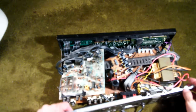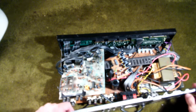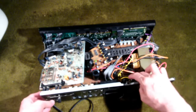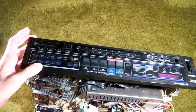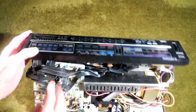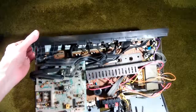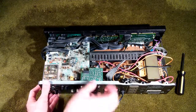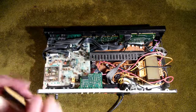And you just got to put it all back together. Be careful on this back plate — these cables are kind of short and they break real easy, and then you have to find yourself resoldering them, assuming you know exactly where they broke off from. When reassembling, one thing to keep in mind: this little volume slider has got to line up with the volume slider on the board, because when you pull that board back they separate. There's a little notch there to where you can match them up. The hard part about reassembling this thing is there are so many holes, connectors, and everything that have to line up all at once. Remember the one screw that holds that board in — very important.